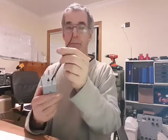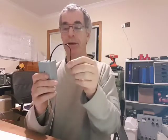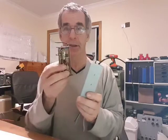In the meantime, I was rebuilding the IF cans, and some of them have the wires attached now. These are for the top caps, so the next valves and the next stages. Not all of them had them. There's two here. The BFO, which I haven't done yet, has one, and this is IFT4. We'll need one as well.